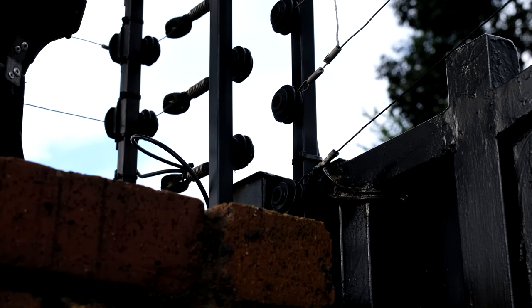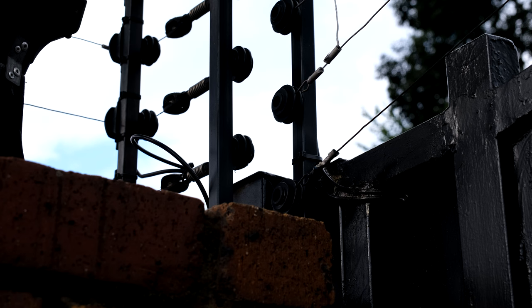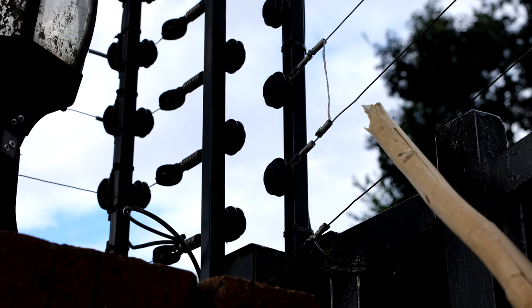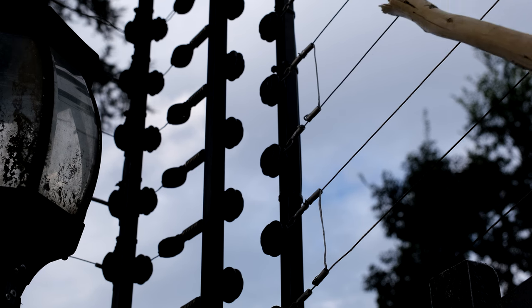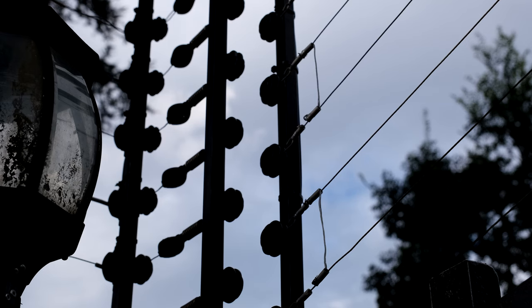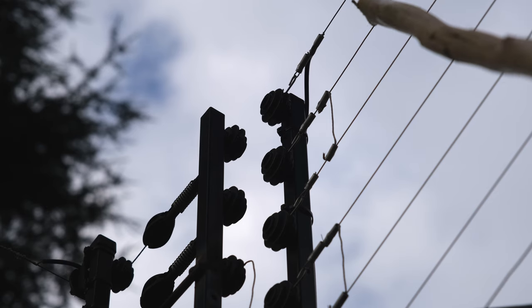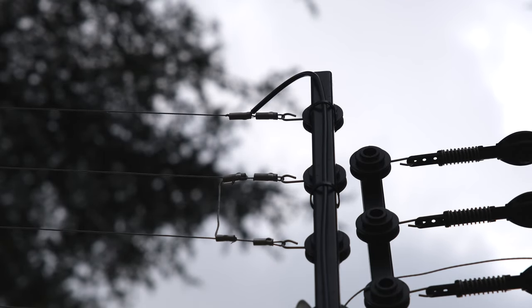If you have a look at the wiring on the electric fence, the very first wire is just going in that direction. Then when it gets to the end, it's jumpered to the next wire. It will return on that wire. Then that wire is jumpered to the next one and it goes along to the other side of the gate. Then that one returns, and you follow that same principle right up until you get to the 12th wire. Right at the top of the gate, you'll see there's a wire running all the way down to the return at that contactor.